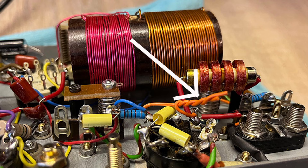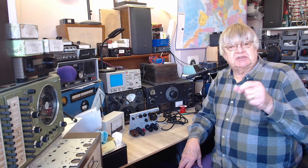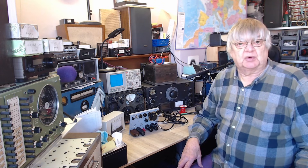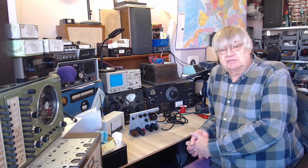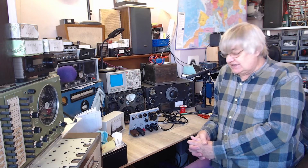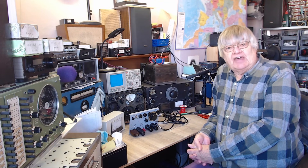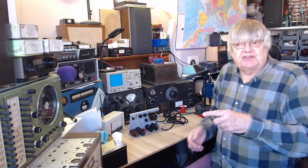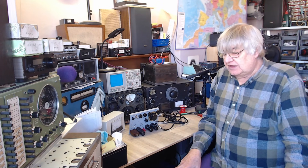Here's a picture of a little bit of twisted wire between the anode and the control grid of the 6V6. That's just to add a little bit of capacitance - a few picofarads. Twisted wire like that just gives a few picofarads - I like to call it 'puff'. That just gives a bit of feedback to keep the oscillator going.